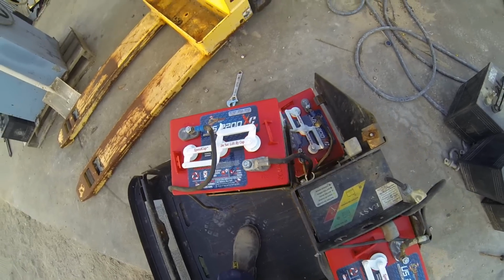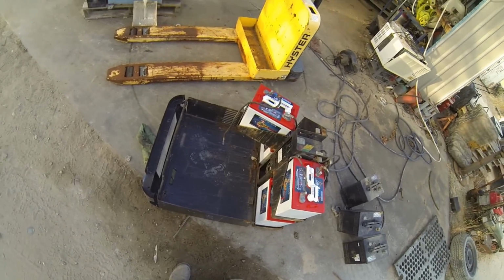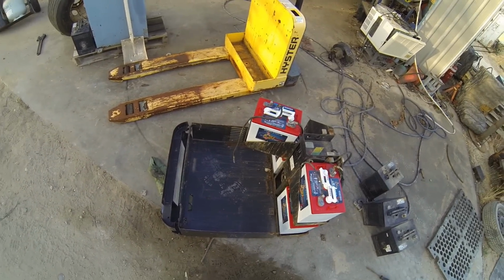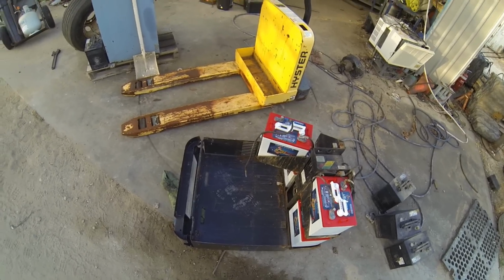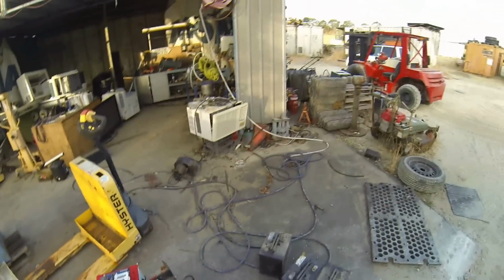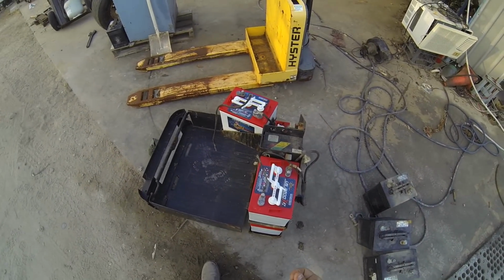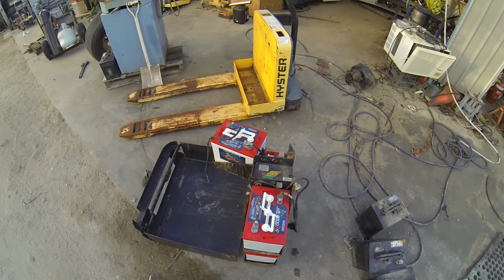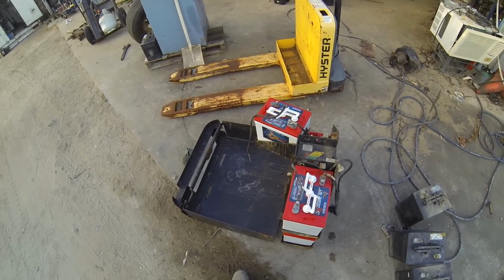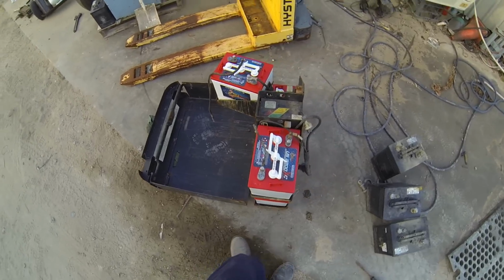That's pretty decent. I'd love to have them on my solar setup, but they're lead acid, not AGM. Ideally you want AGM for solar because it absorbs the charge much faster, so it's much easier to charge the battery. You want to get every ounce of solar energy into the batteries that you can. You don't want to be stuck having current pumped into the battery and it's not really doing much, if you understand what I mean.